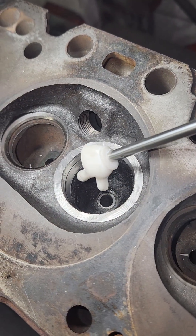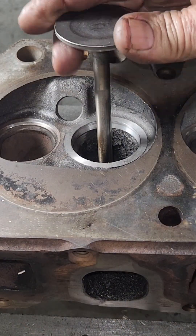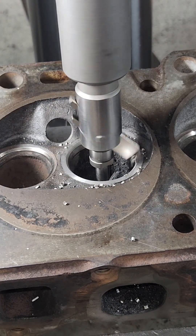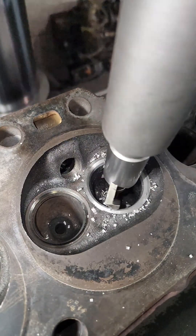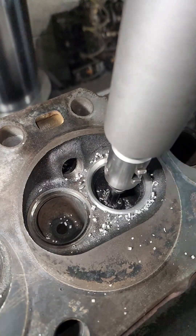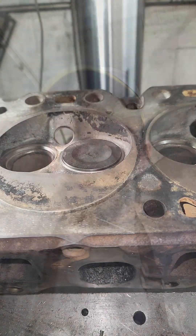You can see I blended that 70 all the way down here to the factory port. This seat's all the way down. That ring is a factory ring where they cut it just a little bit too big. Now let's put some angles on it, because the valve still doesn't fit. You see that valve bounce? That means that seat is concentric. I'm still going to grind it after I'm all done with the rest of them. I'm going to put hardened exhaust seats in it.